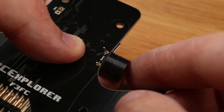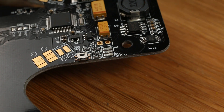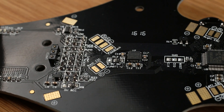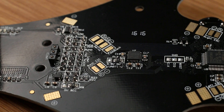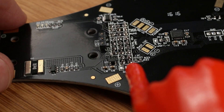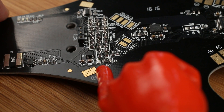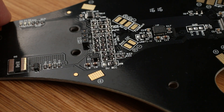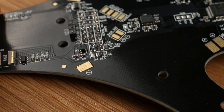The built-in switching BEC has a selectable voltage output. For this build I'm using 6 volts for a bit more torque and speed on the servo. The standard is 5 volts, but to change it just bridge the pads. There are also two other voltage selectors: one sets the UART1 output voltage between 5 volts and 3.3 volts — if using a Spektrum satellite receiver, be sure to select 3.3 volts. The other selector covers the remaining UARTs and two PPM channels, allowing you to use the onboard 5 volt regulator for voltage-sensitive devices while running a high-voltage servo. Note that this regulator delivers no more than about 200 milliamps, so don't power LEDs from it.